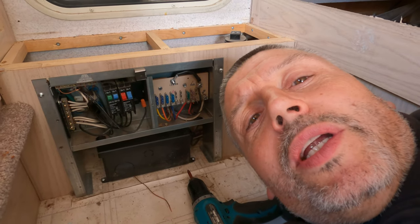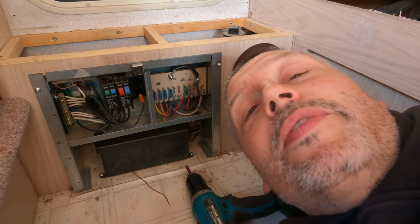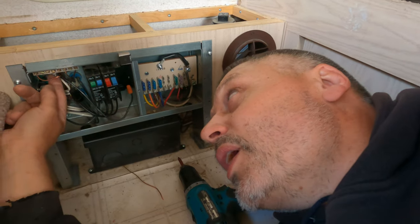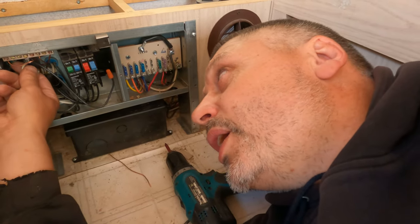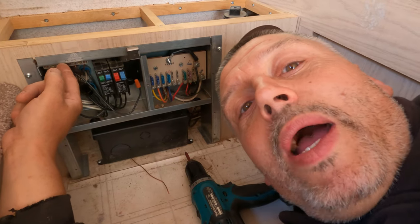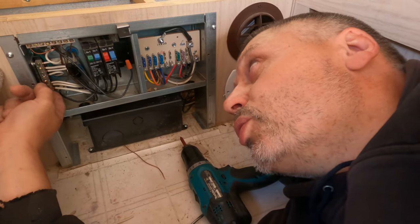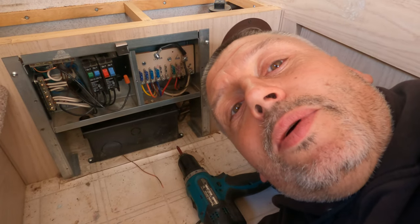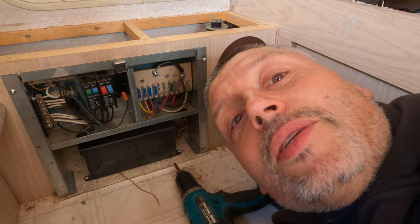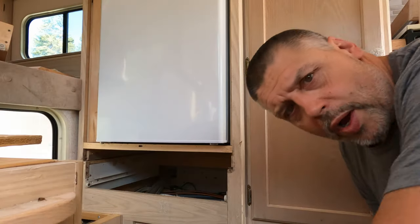That circuit for the charger is wired in — ground to the ground bus bar, neutral to the neutral bus bar, and the hot over to the breakers with a mar connector on it for now. One note of mention: I'm not an electrician, so double check anything you're doing. Always make it as neat as possible. If you're ever in the fuse panel or breaker panel, make sure your power is off, and double check the tightness of all your connectors, screws, grounds, neutrals, and breakers — some of them will be loose. Loose connections are a fire hazard.